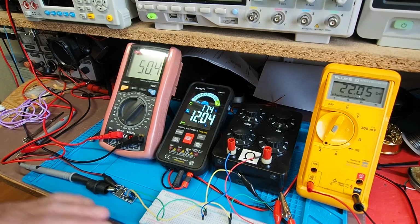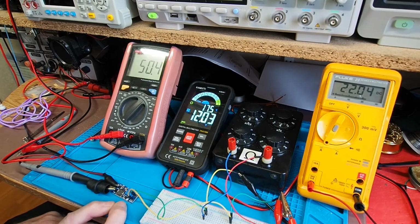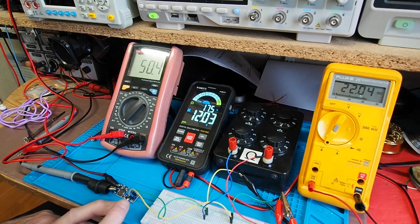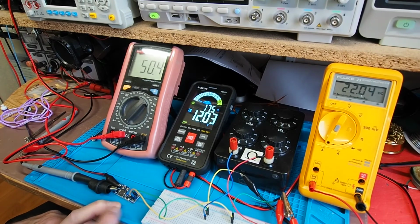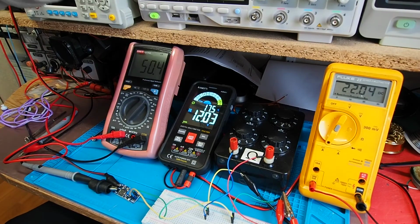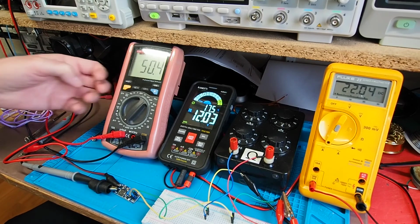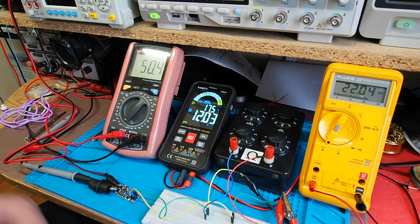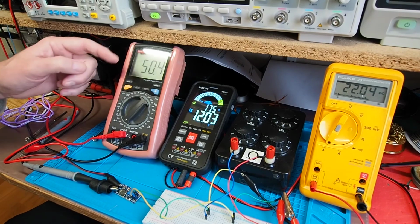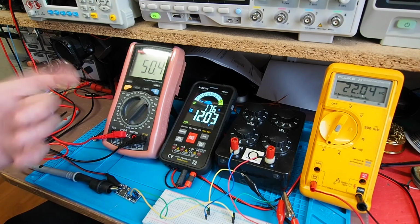So the reason I wanted to do that is because if you're going to use this with battery powered equipment, if you look at some of the spec sheets, and the spec sheets I've looked at were for Duracell AAs and for Energizer AAs, the manufacturers like to quote a load of 50 milliamps. So I thought it might be meaningful to show you the kind of current that was available at 12 and 24 volts if you were going to use 6 volts of alkaline batteries as the supply. So let's say 4 AA batteries. Obviously if you're using a power supply, this is inconsequential, but that would at least give you some idea of the current you'd have available, which is actually quite reasonable for running electronics with that 50 milliamp input.